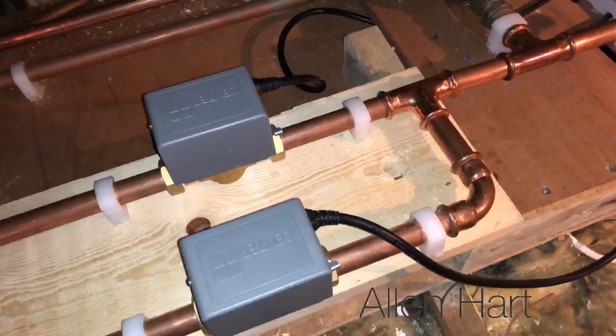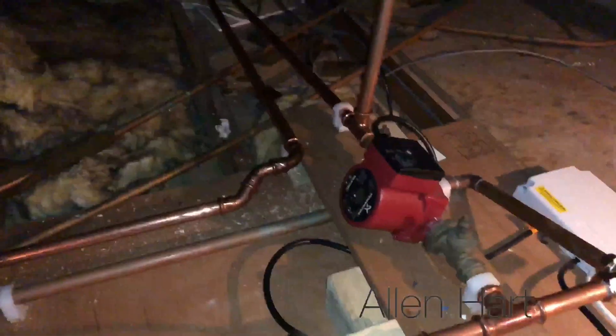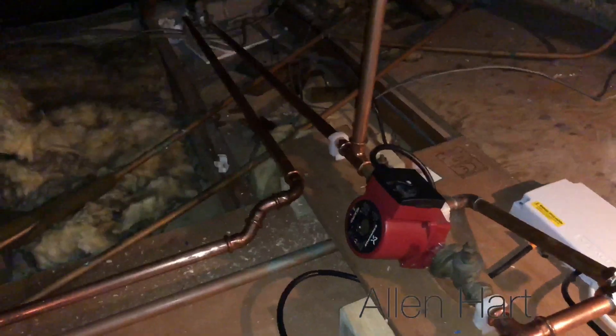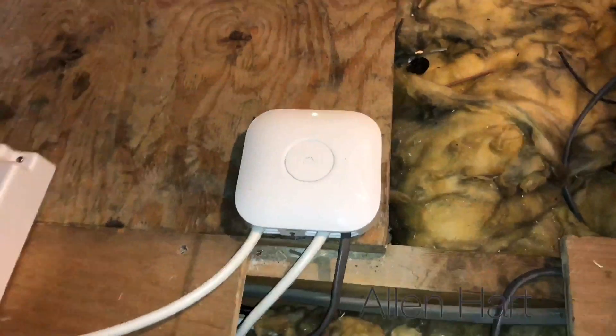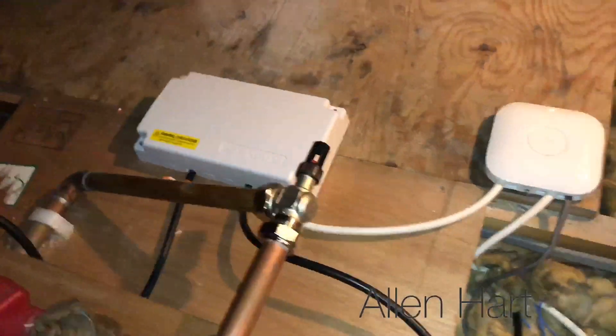It's all updated now to an S-plan. We've used press fittings because we're up in the loft — we don't tend to use press fittings anyway but it's a lot more beneficial when you're in a loft because you wouldn't want to have a blowtorch on up here. We've wired the Nest in so that's all up and running, and we've got the wiring center there all nice and neat.